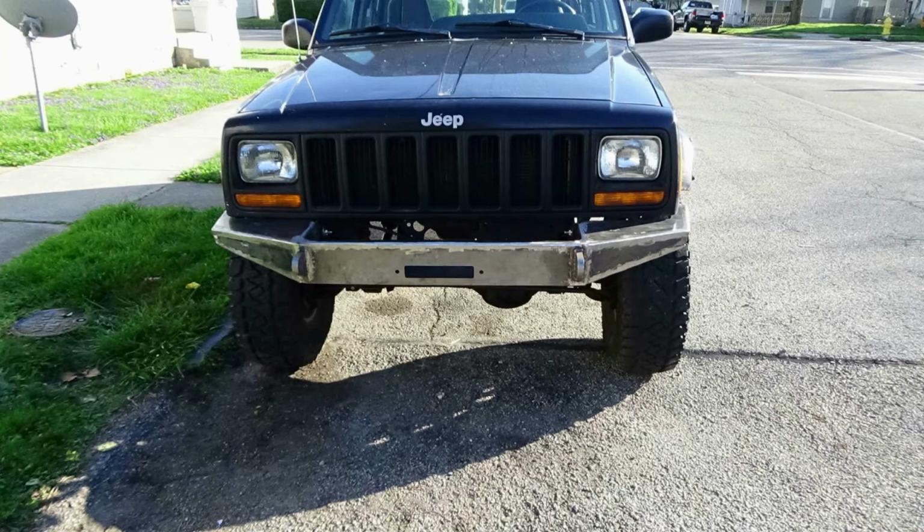And again, I want to modify those brackets on the bumper that actually bolt it to the frame rails, the unibody. I would shorten that a little bit so that the bumper can sit back and line up with those fender flares and against underneath the grill like I wanted, because it sticks out a little bit more than I would have liked, and I don't think it looks that cool as it is. So there's a little bit more welding to do on the lugs and stuff, and again, I didn't film that or really finish that because I knew I was running into those issues.